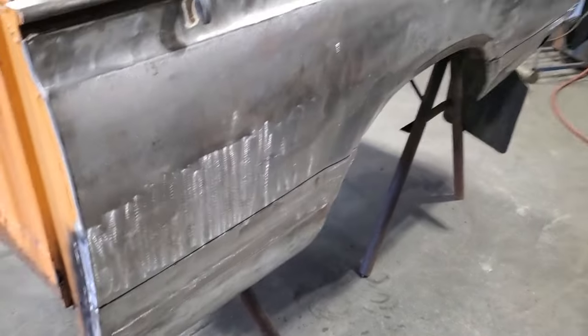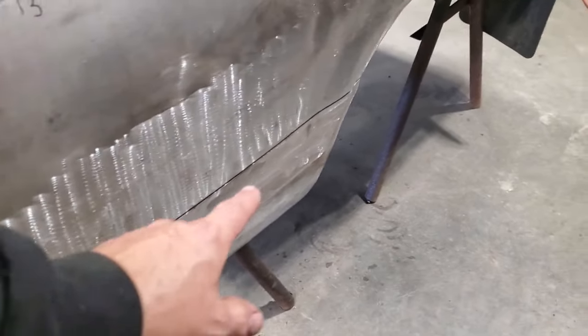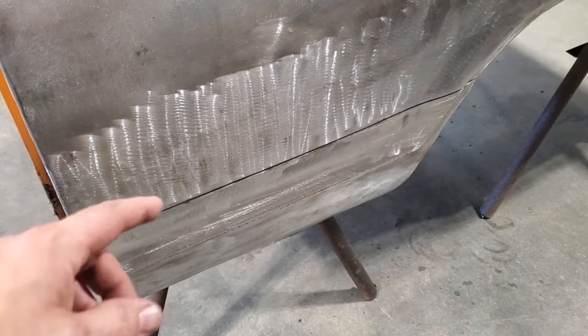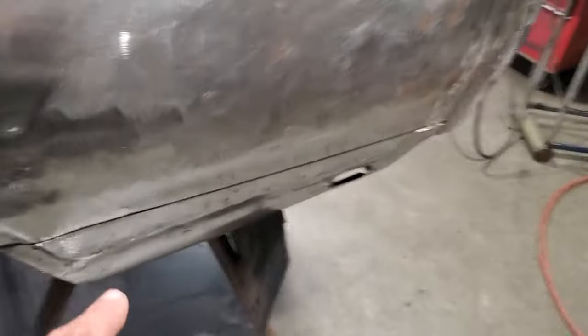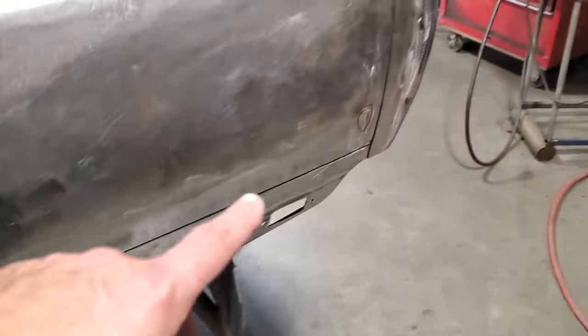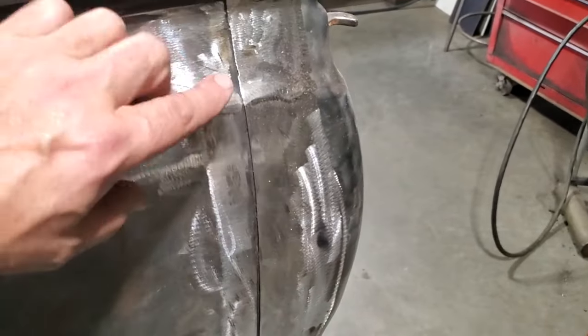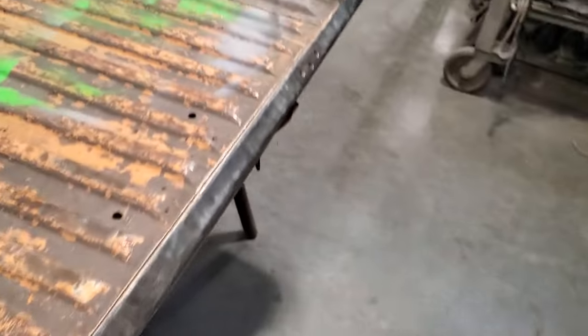Okay, in the last video, how to make factory seams from rusty metal, I covered repairing this section here, so if you want to check that out, link will be in the description below. I went ahead and finished up the rest of the outside of the box on this truck. I did the same thing back here. I had to do a lap joint back here and repair this. This was all rusty along here, put a strip in here and a piece in here. And then I went and did the same on this side.